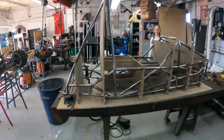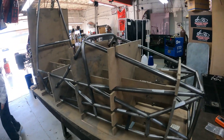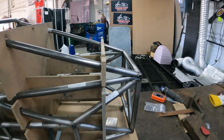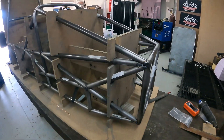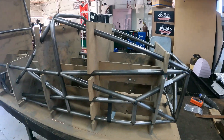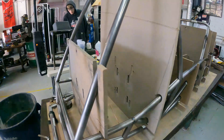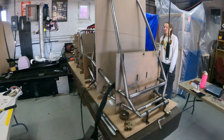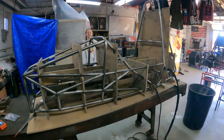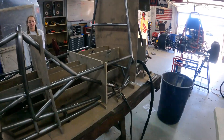We've got a fully tacked chassis. The fit-up on the front was a little difficult — it looked like it was going to be pretty rough, but once we started tacking it pulled things into alignment and the gaps aren't too bad. The front bulkhead went on there pretty well. These tubes were tension fit — once we tacked this tube, those two tubes in, then all this stuff was just held in place. It's currently 4:18 and we started at 10:30 or so, so that's about five and a half hours to go from just tubes to a full chassis. Now it's time to tack the inside of all of it and then start the welding process.